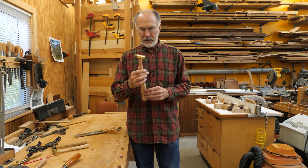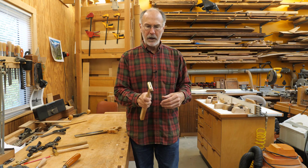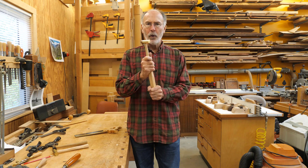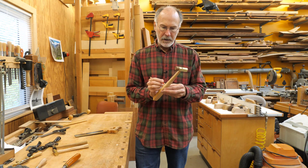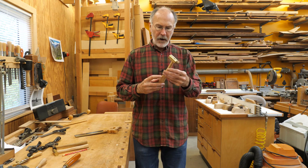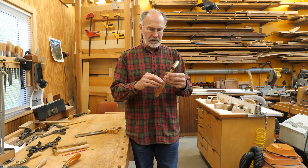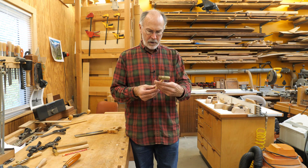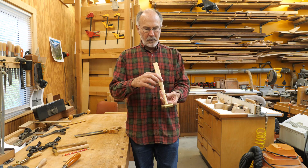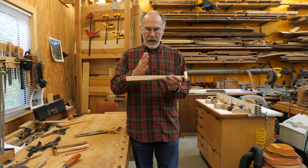The last thing I want to do is cut the handle to length. Before I do that, this is the last time I'll be able to take the spokeshave to it, so I want to make sure everything feels good. I want to get a sense of where it's comfortable to hold, make a note, and I want to cut it about there — put a pencil line there. You might also want to make sure you've spoke-shaved all the surfaces so they're all nice and clean. In this case they look pretty good. I might want to round a little bit more since I'm not quite symmetric here, but then I'll clamp this in a vise and cut that off.